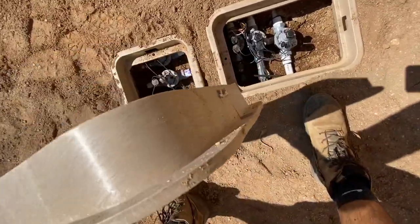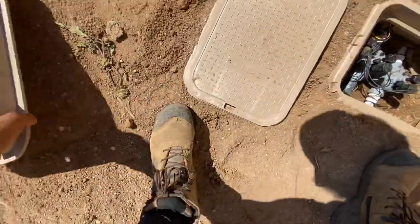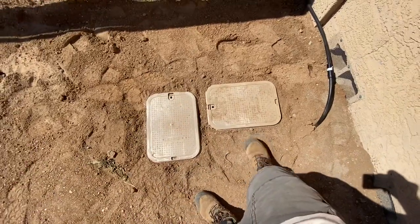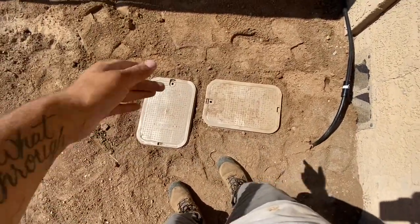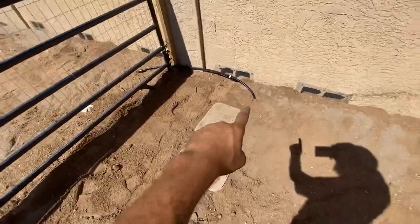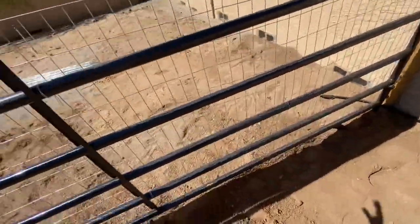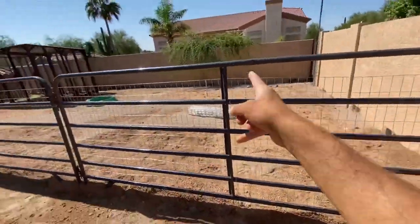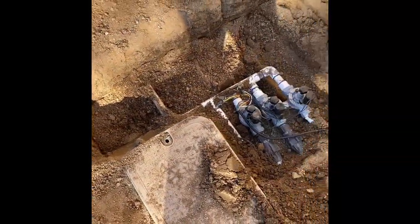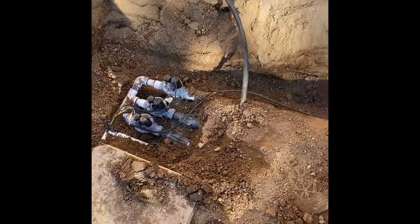Also, what I like to do with these valve boxes — I like to break off the bottom pieces just so you don't have to try so hard to close and open them. These aren't in the city where somebody's going to try to mess with them, where you actually need to lock them. This is in somebody's backyard, so you can break those little tips off. As you can see, we have that three-quarter line running right through, and then we have a little cap on the end. Eventually when we come back, we're going to do this chicken coop — we just need to get some more half-inch perforated line. That pipe needs to be capped off where that 90 is — it's going to be a T and then a 90.